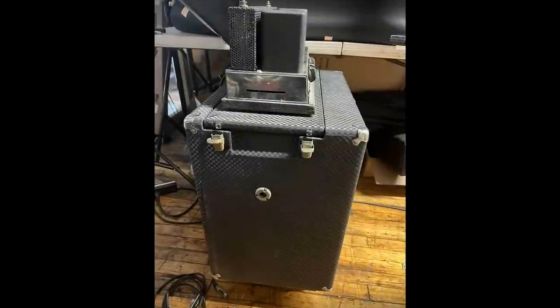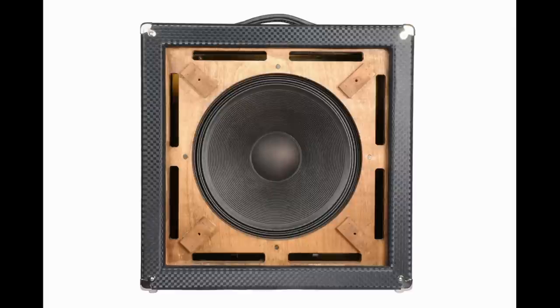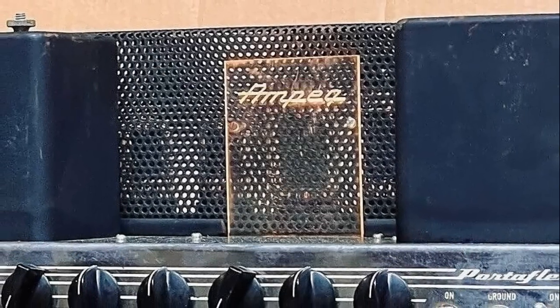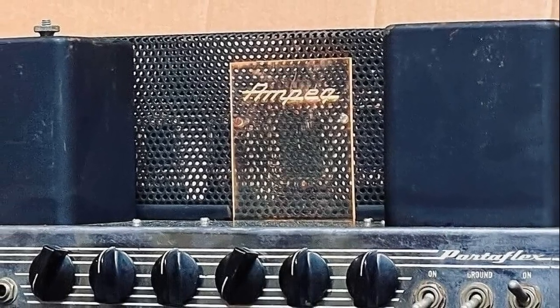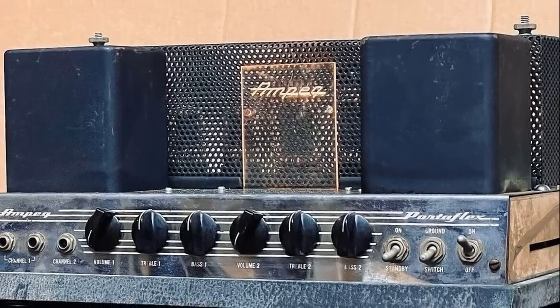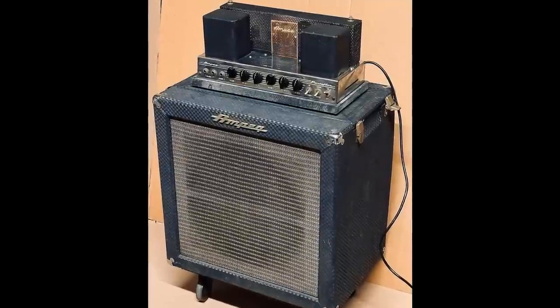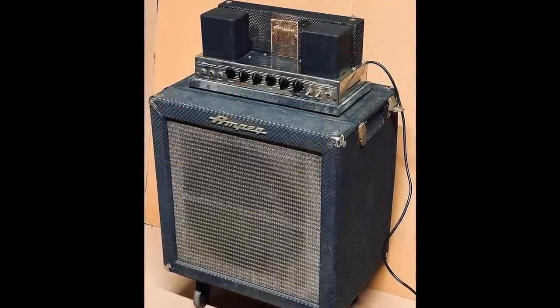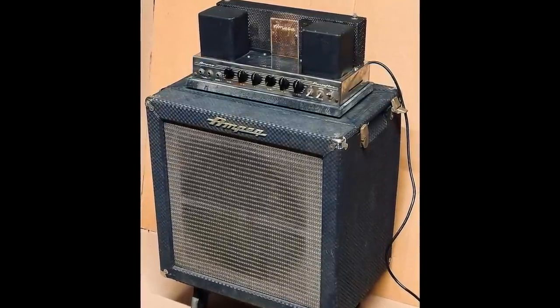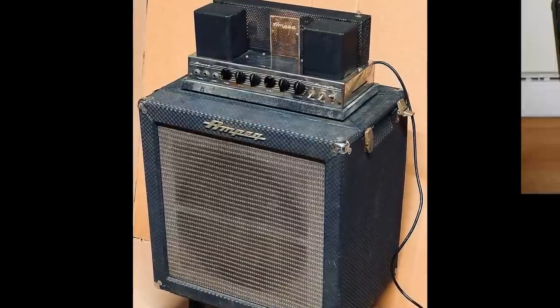It was a single-channel 25-watt head with a flip-top, double-baffled cabinet. It cost $355 new and had a 5U4 rectifier. Later versions of the amp featured a cool Lucite Ampeg logo which lit up when the amp was turned on. In 1962, a solid-state rectified version was introduced, along with the now familiar blue diamond covering, and in 1965, the output was switched from cathode bias to fixed bias.